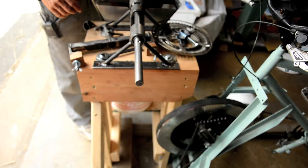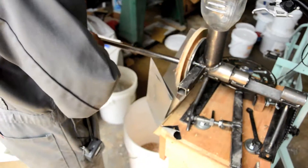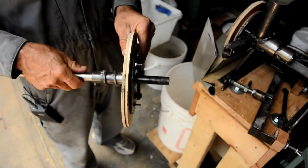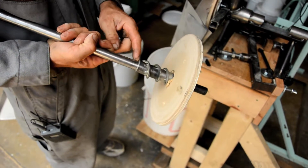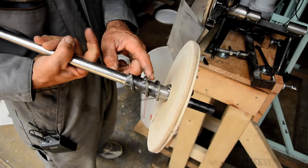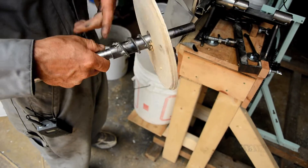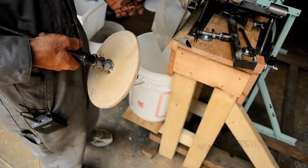The shaft comes out — we dumped a little bit of einkorn out there. This is the runner plate and auger. You can see this is a three-quarter shaft, and we have a 0.76 ID piece of tubing that has a bent coil of keystock wrapped around it, and that makes the auger. So when the thing turns, it augers the grain into the two plates.